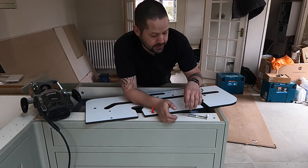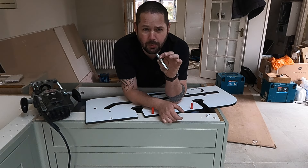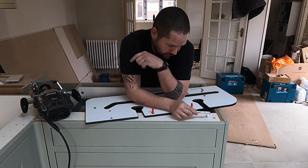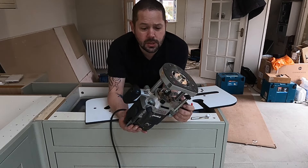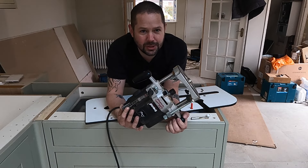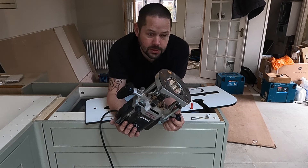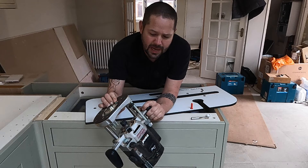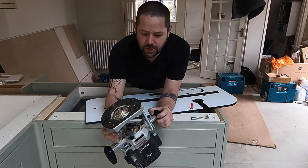The things you're going to need to do this: you're going to need a half inch router cutter — they come in two different lengths, I'll put the sizes down here. This is the shorter one, it's not really long enough but it will do for today. You're going to need a half inch router to do this, the best one you can possibly afford. A quarter inch router is not going to be man enough and the cutters won't be long enough. This is a Trend one, they're about 200 pounds, but you can get cheaper half inch routers.